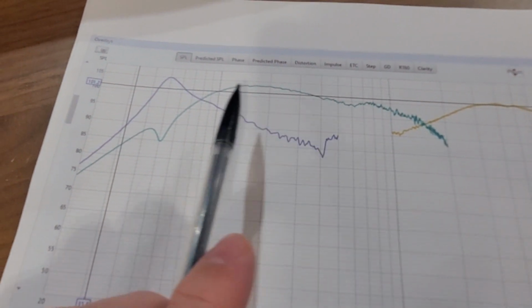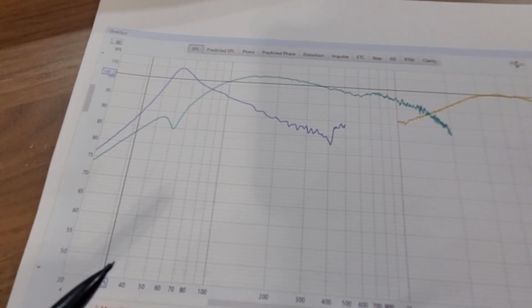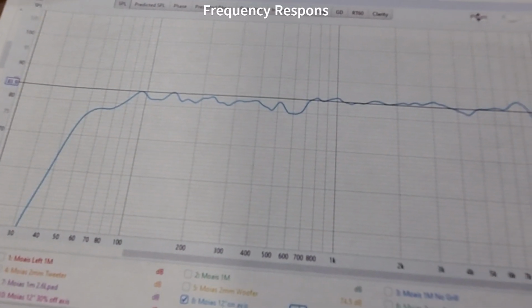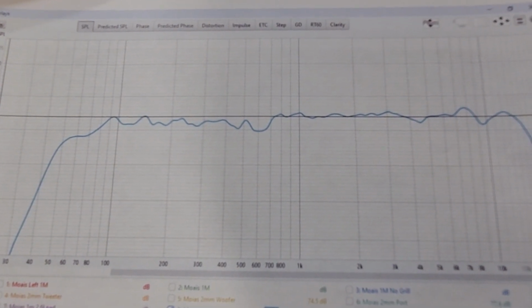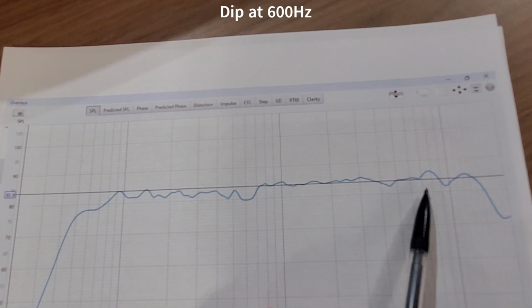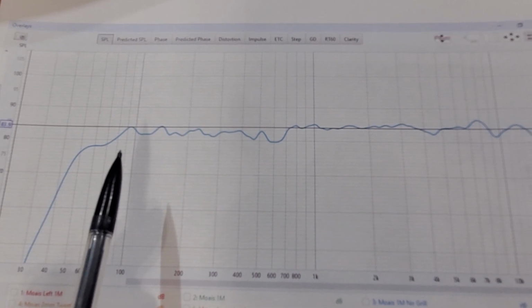The woofer response there, again, pretty smooth here. And this is at the port tuning here, at the port level there. But overall, a pretty well-balanced kind of response. The combined response together, again, looks very linear. There is a little bit of a dig out right around 800, and I think another little one near the top here around 8K. But overall, a pretty linear response.